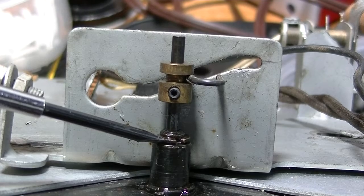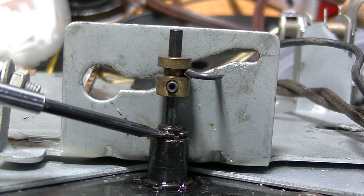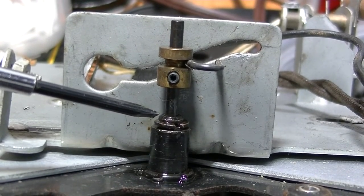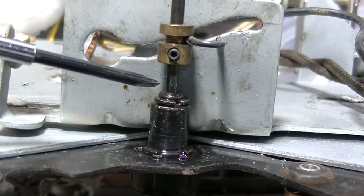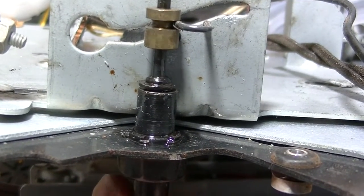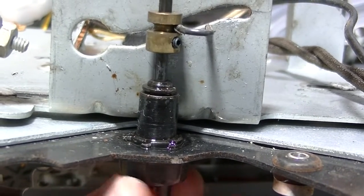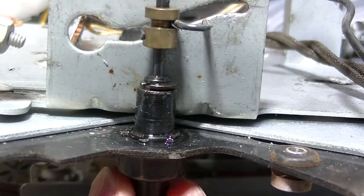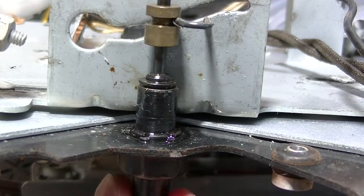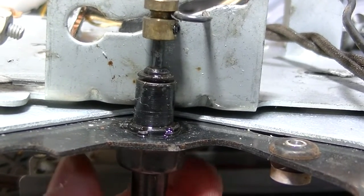The spindle has a C-washer on it, but it's not coming off for me. If it doesn't come off, I don't want to force it because it may be destructive. So I've lubricated it as best I can. It's not as smooth as I'd like — it feels a bit viscous — but it is turning. I'm going to leave it and see if the motor will actually drive it, now that the friction in the motor and everything between it and the spindle has been reduced.